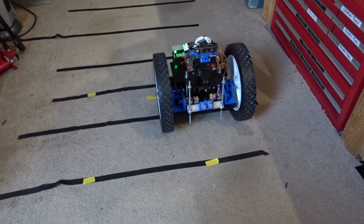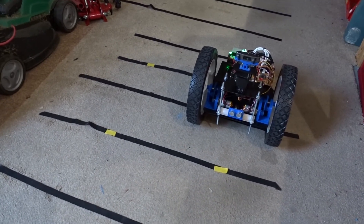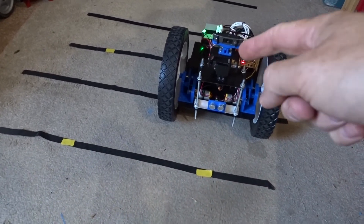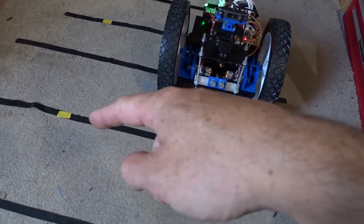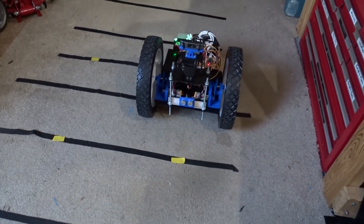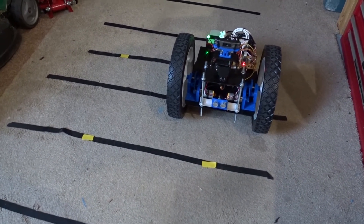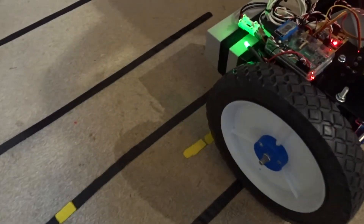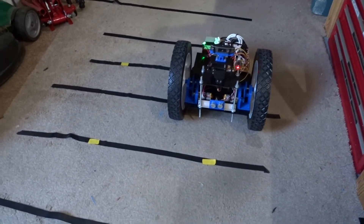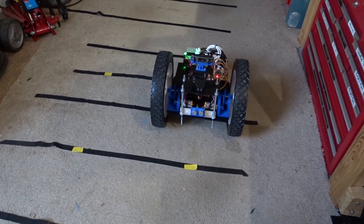With all the previous work to get the robot to drive in a straight line by a given distance and turn to a given angle, I've got a little program to drive forward 400mm. These tape markers are the corners of the square — so turn 90 degrees, drive 400mm, and so on until it's back to where it begins. I've also programmed a camera scan at each corner. I'm going to run this test and see how far away it is from completing a square, then begins probably a fairly long process of calibrating and making adjustments to try and get this more accurate.